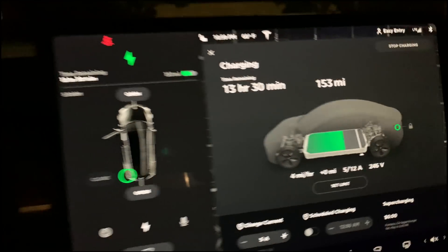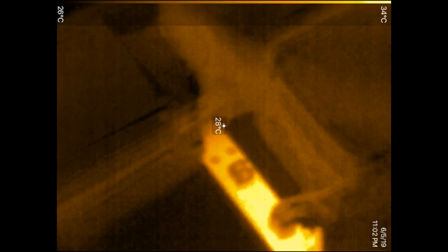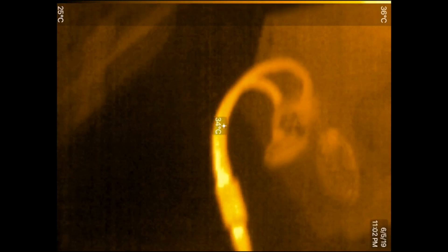We're nearing about four minutes into this 1.2 kilowatt sustained charging of our Tesla using batteries. So far the only thing that's hot is that PCB, and it's at 34–35 degrees Celsius — not super hot. This is probably the hottest part right there because that's where the connector is. I might move some of these batteries to that side. The cables here at a sustained 42 amps — that connector is at 35 degrees, which is cool, just slightly starting to get warm.